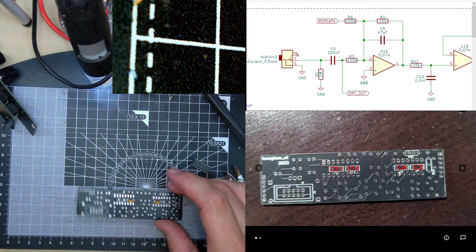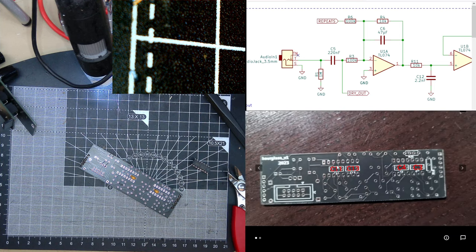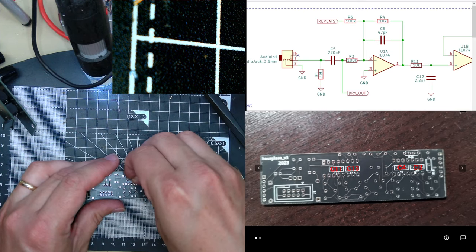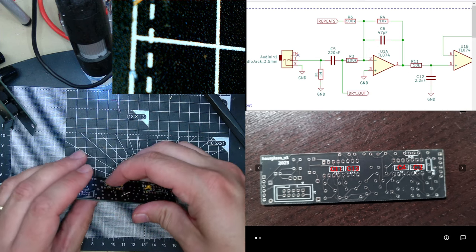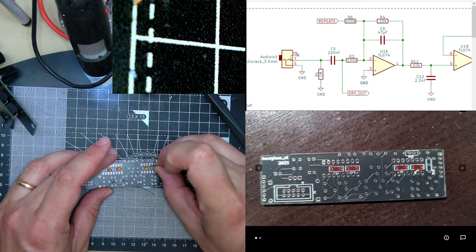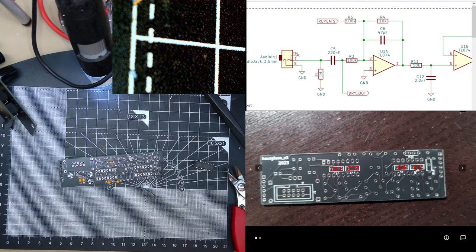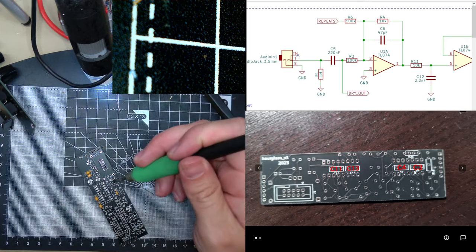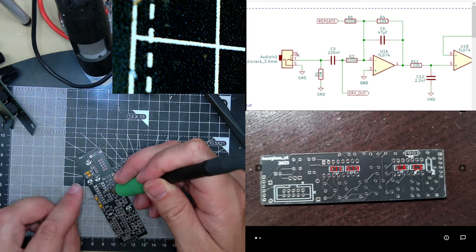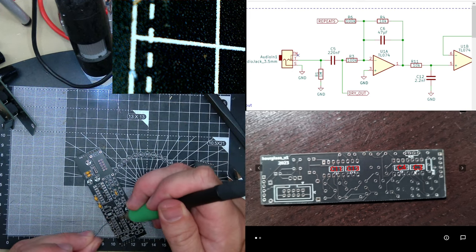Yeah, I always recommend looking at, maybe if you're using KiCad, use the 3D viewer. C3 and C11. So they're all these ones at the bottom, the decoupling. I'm guessing decoupling of these two ICs. I'm not sure if I'm a massive fan of putting the capacitors underneath like this because they're not going to be accessible. What if I got them wrong? I'd have to remove a whole socket just to fix them. We'll do some kind of hack where I cut the leads and then dab them back in. And I can see there's plenty of space up here and down here that could have had capacitors.